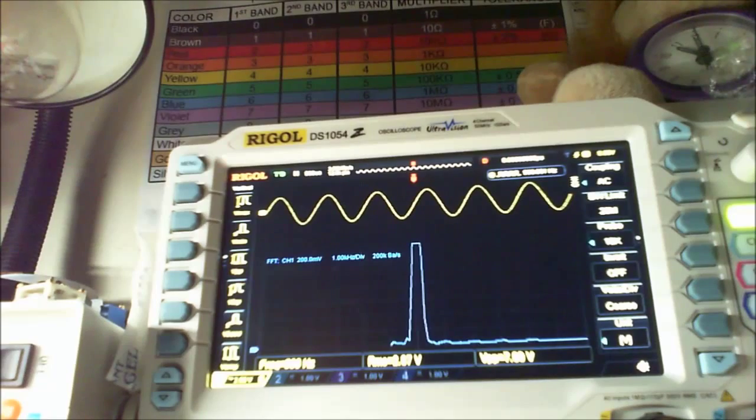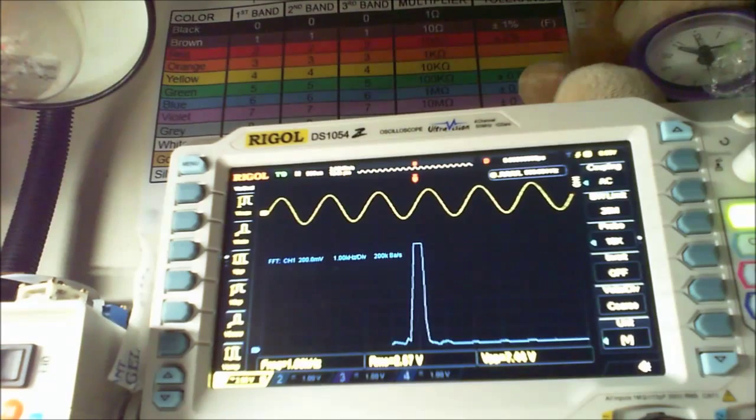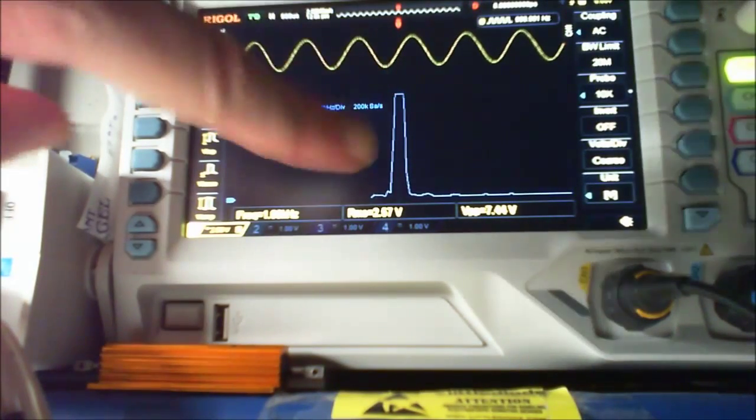Ah, look, we are clipping just there. So we've got about 2.57 at 12 volts, which isn't too bad, for the little eBay kit. Because this is the eBay LM386, and the one that's actually on test is the one that I put together, the TI. As you can see, at plus 12 volts, there we get 1.99 volts RMS, but we get 2.57 with the TI. Now, don't worry about this, that's just in there.